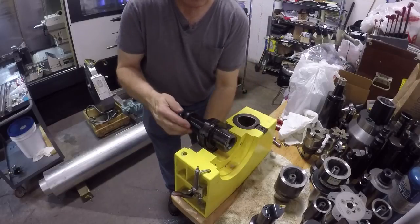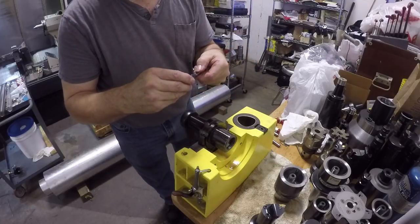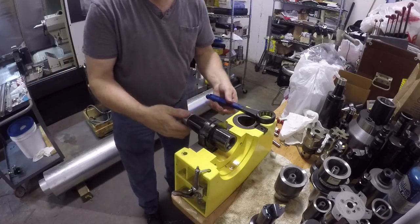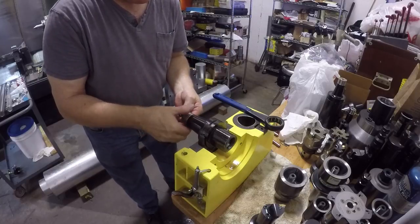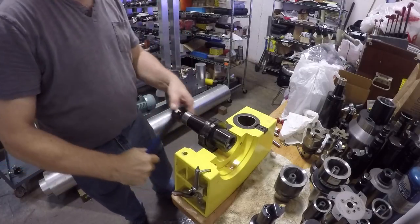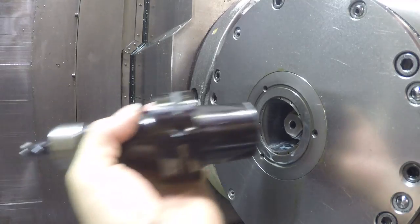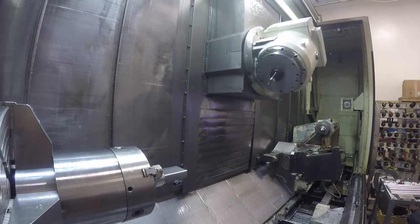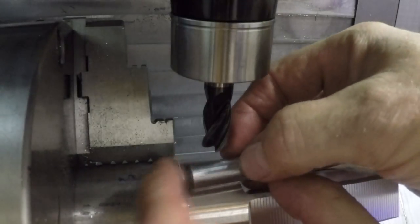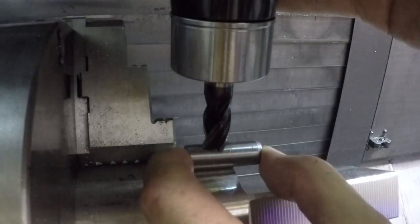This is really nice because you don't have to rely on keyways like you do on CAT tapers. I happened to have this half-inch end mill on the bench — it looked pretty good so I put it in the collet chuck. These collet chucks are sold by Big Kaiser, brand name Big Daishowa, and they use a one-way bearing on the wrench with no notches in the nut. I put it back in with the shorter tool shank and touched it off on the work — I turned a little diameter up there so I'd have a known diameter to touch tools off on.